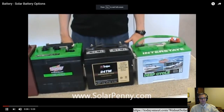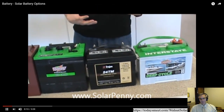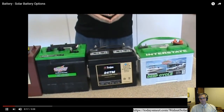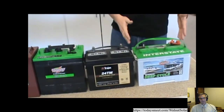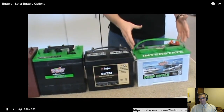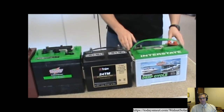Hello, this is Aaron with SolarPenny.com. Today I kind of wanted to review different batteries. Batteries is a common question we get. A lot of misinformation about batteries. Our first kind of battery is a marine or RV battery. It's basically a modified car battery. It's rated in cold cranking amps. This is actually a terrible choice for solar.